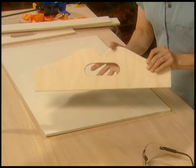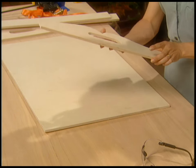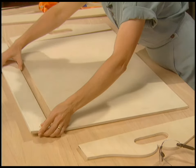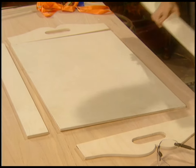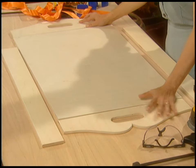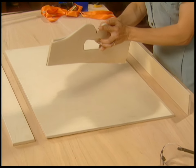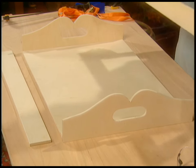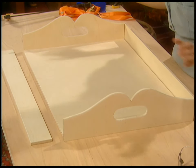Choose whichever side you think is best on the outside to make a good impression. I've only rounded over the tops of each of these boards because I want the bottoms to sit flush. The dimensions: 20 inches deep by 30 inches wide, so the base is cut exactly that. The two end pieces are cut exactly 20 inches wide. The side pieces need to be 30 and three-quarters inches, because two pieces of three-eighths plywood make three-quarters of an inch. If you want to cover those ends, make the side pieces a bit longer.